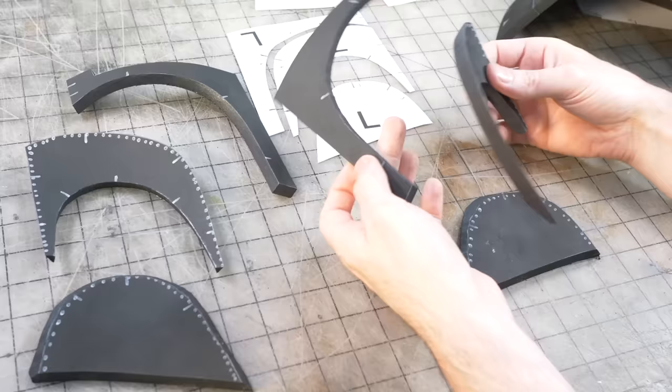I mix up some Epsilon Pro, which is an epoxy, and I'm going to use that to seal the whole surface. This provides a more rigid surface that can be sanded really, really smooth. A little more expense and a little more work, but the results are pretty great. Our epoxy is fully cured. I let it sit overnight in a warm environment. It's nice and fully cured.